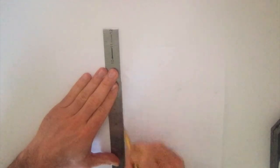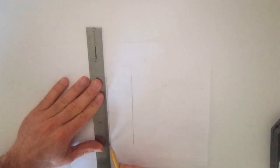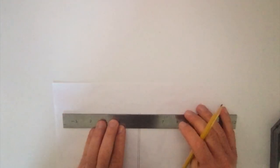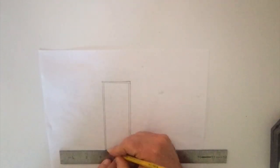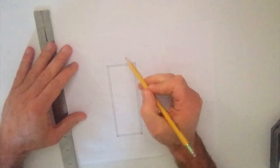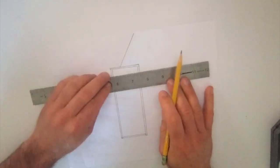So I wanted to show you a little bit how I made it. We'll start the design by drawing out the two 2x6's that we'll be using for the sides of the unit. From there we'll go ahead and draw the top — this is also going to be a 2x6 and it'll be 29 inches long, which will cover the entire top of the unit. At the bottom we're going to draw a 2x4, not a 2x6, and it'll be 26 inches wide because it'll be sitting in between the two 2x6's.